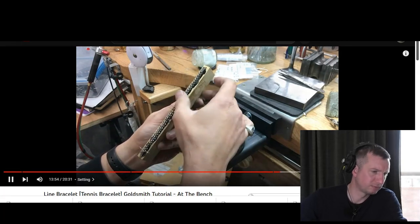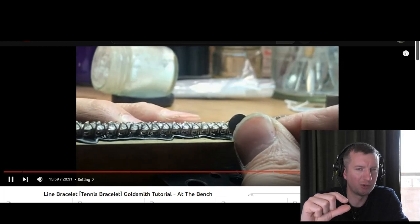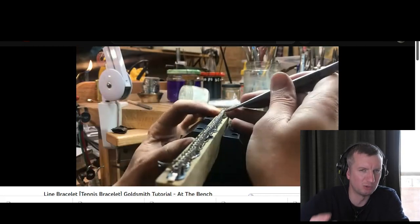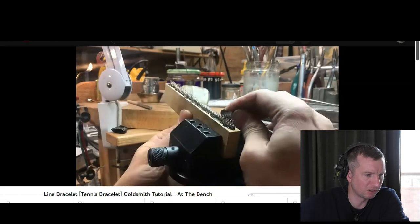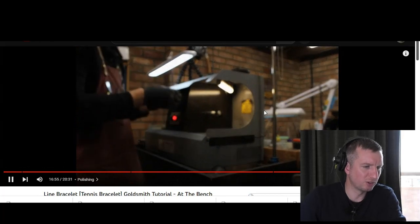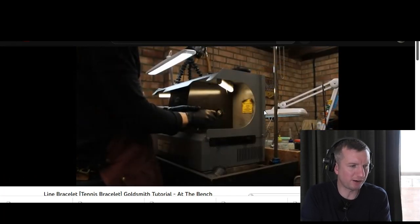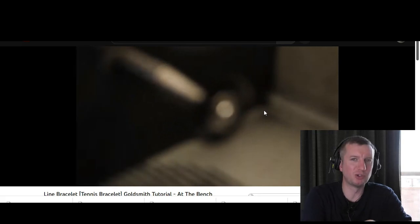He's setting on a piece of wood. I learned really quickly that the longer the claw, the easier it is — you've got more leverage to push over the stone and more control over the tension, direction, and angle of the claw. Bristle brushes — yes, I'd definitely choose those. With loads of grease on there they cut really well. You can work with a lot of control without wearing out the metal — just rounding off funny bits, good for removing scratches. For fire stain on silver, those black strong bristle brushes are the best tool.